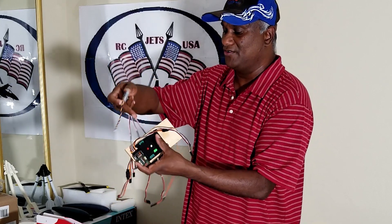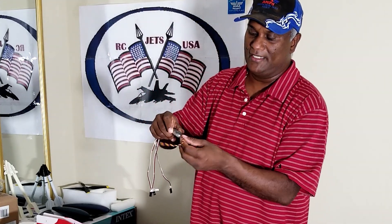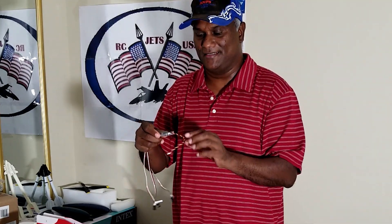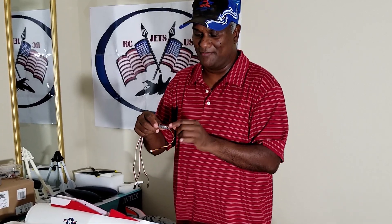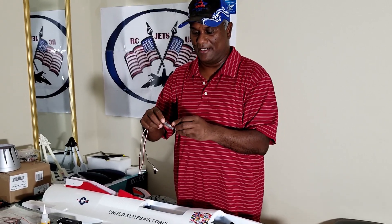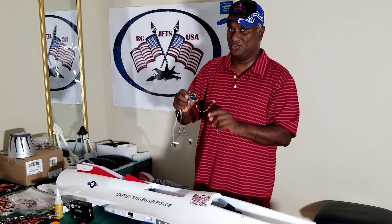There will be six wires coming out of the receiver and six wires going out of the gyro to the control system. Here I have permanently placed the data cable, because there are a lot of updates coming — it is computer-driven. It is very easy to get it connected this way; otherwise, it will be very difficult to access the slot and remove it every time, and it will break. So I just keep it permanently attached here, so that if I want to do software updates, I can just do that very easily.